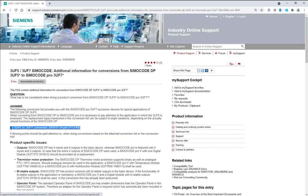Additionally, it includes a PDF file for the conversion from SimoCode DP to SimoCode Pro system. The conversion PDF includes a full list of components you need to replace a SimoCode DP device with all its functionality. This can be used for a rough conversion without having a closer look at the real application requirements. To reduce costs and also the required space, you should have a deeper look at the real application details.